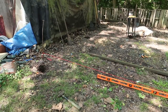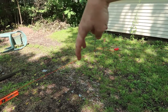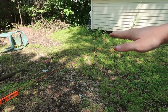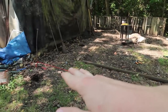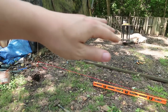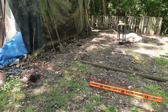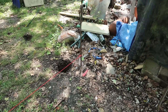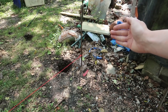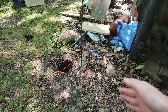I'm assessing how level the backyard is — looks like it's off by a few inches, maybe five inches. That area right here is kind of a little higher, so if I get that down it'll take off like an inch or two. I can move that dirt over here to bring that area up by maybe half an inch, so that could get the levelness down to only a little bit. I don't really need it to be totally level for the floor, but I want to make sure whenever I start building this side of the shed that it doesn't make the other side stick into the ground.